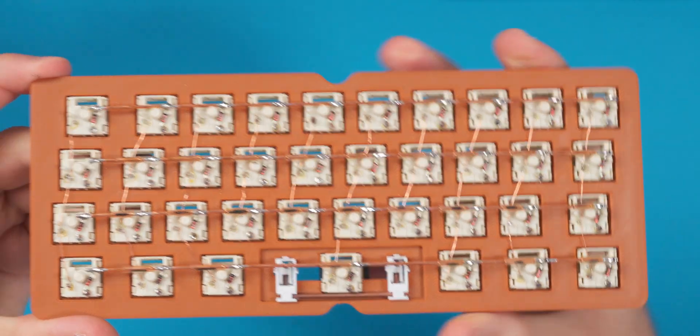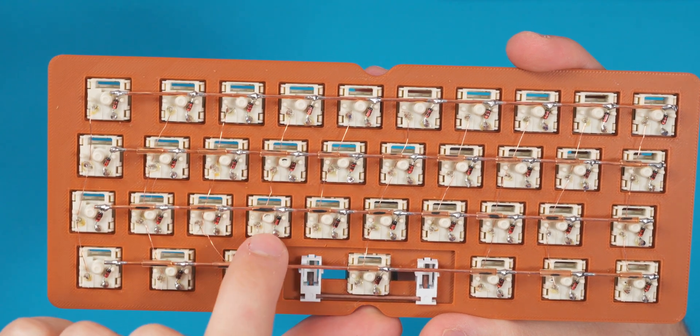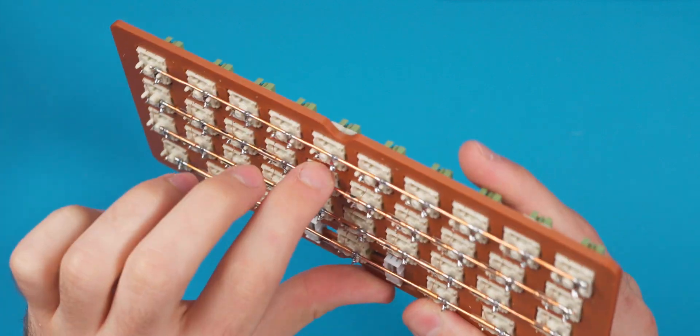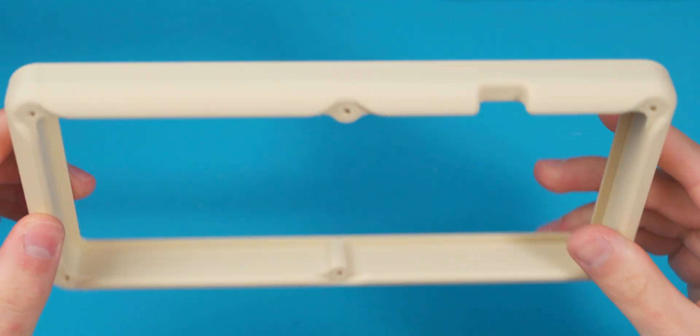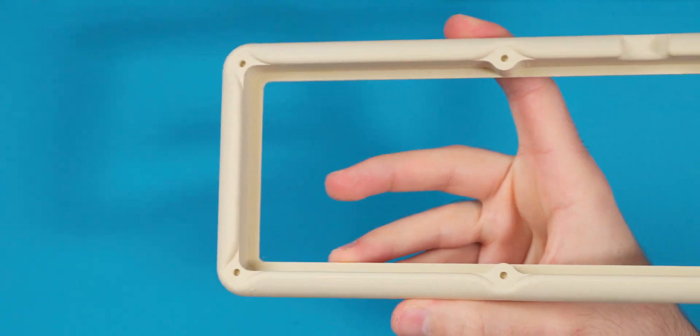The entire matrix is wired up. The rows are nicely insulated from the columns with heat shrink tubing pieces, which is really nice. It also solved the pop-out issue — pushing on a switch now gives much more rigidity. Next I want to talk about the gasket and look at it in the software, but I also want to look at the physical case to explain how it all works together. I'll grab the top bezel first.